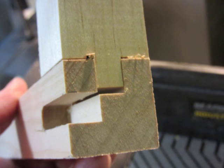Now, this photo illustrates an improperly set up mortise and tenon. You want the joint to be pretty tight, so you either have to wiggle the pieces into engagement with each other, or maybe even have to tap them into position. There shouldn't be a lot of wiggle in there. And also, you should get wood-to-wood joints at every contact point, except maybe the curved end where the router bit goes a bit beyond the technical end of the mortise.